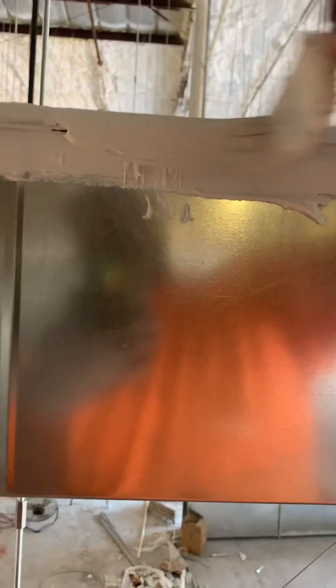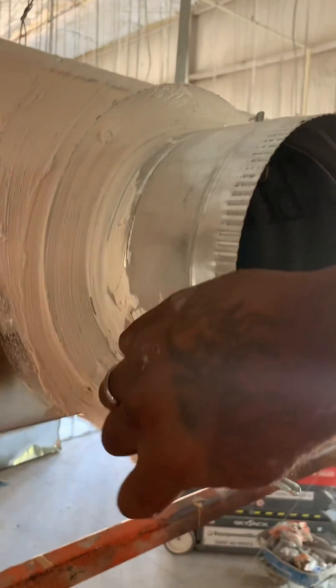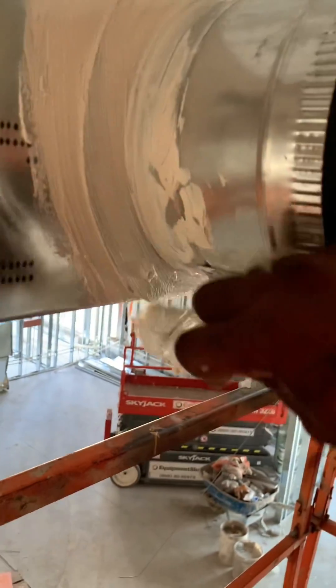So what we're doing right now, we're just applying Pookie — putting the mastic on the duct. That's an air sealant. So we got leaks, any penetrations. Both sides of the Pittsburgh. We just apply the mastic.